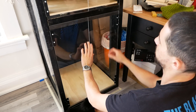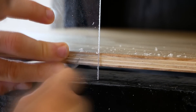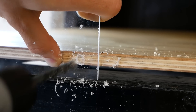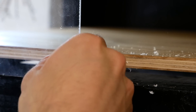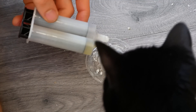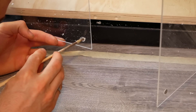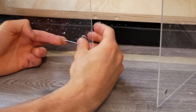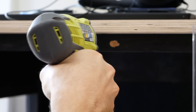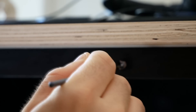Without a way of keeping the doors closed, this enclosure wouldn't be very cat-proof, so I used some rare earth magnets to make door closures. Once I had holes drilled for each magnet, I mixed up some five-minute epoxy to embed the magnets in the doors. The drill marks were a perfect guide for positioning steel screws that would hold the magnetic doors closed. A great part about using India ink is if you find an imperfection, it's super fast and easy to make the spot disappear with a paintbrush and a bit of ink.